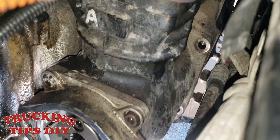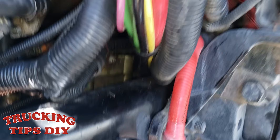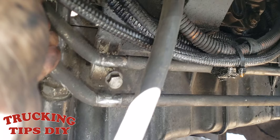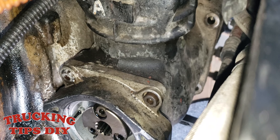This is the last bolt coming off, so the air compressor is completely released. Now all we gotta do is unmount it from the gears and bring it down. We took off all the brackets for the transmission oil hoses and coolant hoses — all the brackets — just to get more space over there. They're all loosened, so we just gotta bring down the air compressor now.